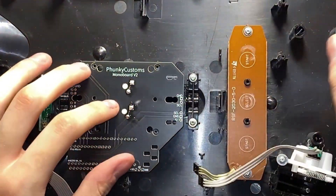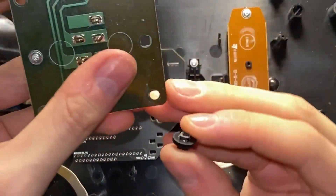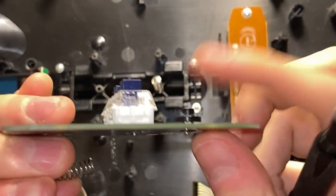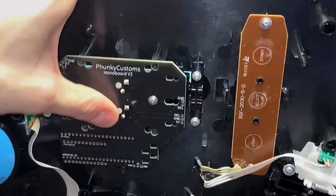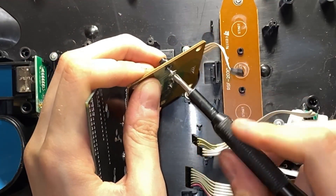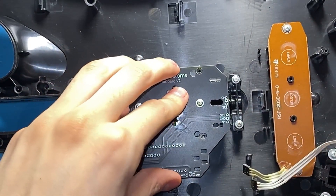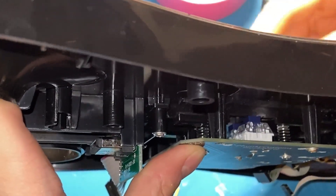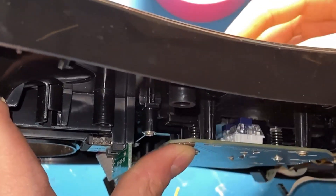So before we screw down the strum bar, we're going to put in the pieces that hold the springs in place, but I did find an issue. You can see that the hole for these things is square, and these are just circles. It raises up ever so slightly. It's going to compress the spring a bit more than it would if it was stuck, but honestly that's not the worst thing in the world. I'm actually having to push the PCB down because the springs are pushing up off the chassis. I did talk to Funky about the springs, and I prefer them, mainly because the World Tour guitar's strum bar is just so big that it honestly feels a little floppy without the springs.